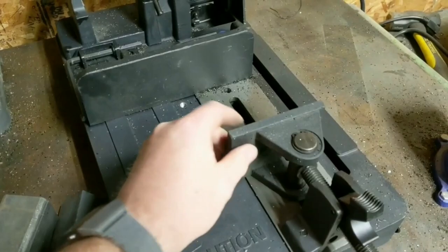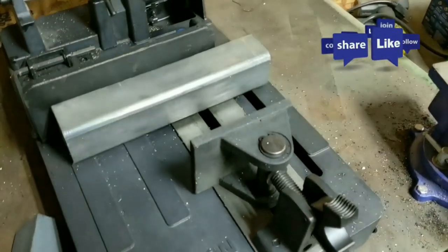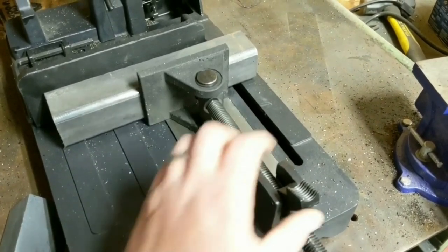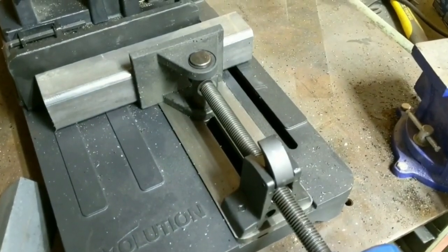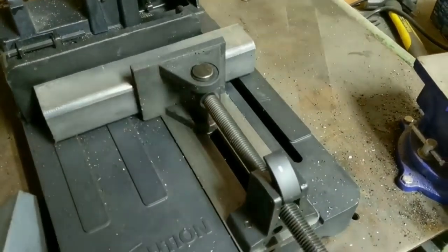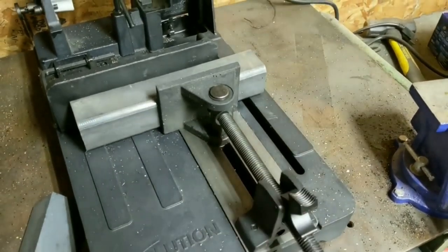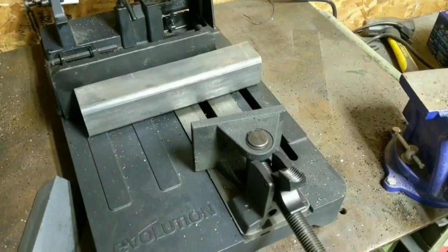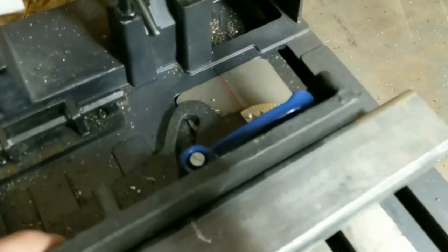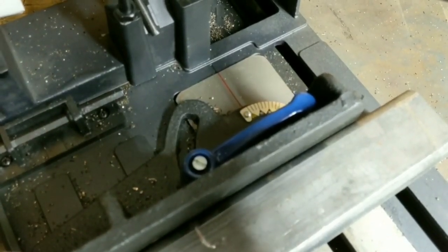The clamping feature has a couple of things I really like. If you lay a piece of stock in there that you want to cut, you don't have to crank this all the way down to tighten it up. You just shove it up, flip this little lever over, and now you can tighten it — you're not cranking the entire all-thread or Acme thread back and forth to open and close it. When you want to release it, you basically loosen it a little bit, flip it back, and you can slide it all the way out. It's a pretty neat feature to save time. It also has a pivot point in the back that you can pivot and dial in maybe a 45-degree cut if you wish to do so.